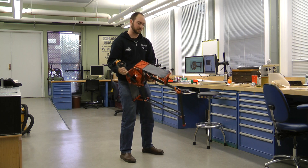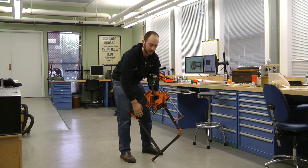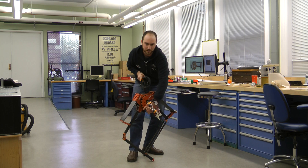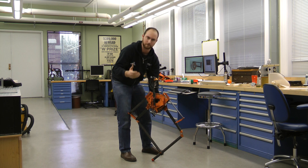You can see it's quite springy. You can see these large plate springs here deflecting under the load. And as you saw, the leg opened up — that's because the motor is actually back-driving. This is totally unpowered; there are no batteries on board. This is just a passive dynamics test, and the motors back-drive a little under these loads, so the leg opens up. That's what you're seeing.